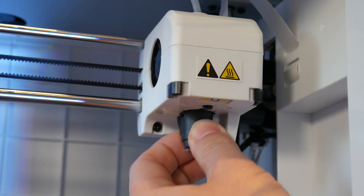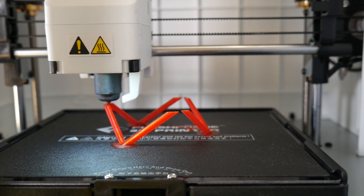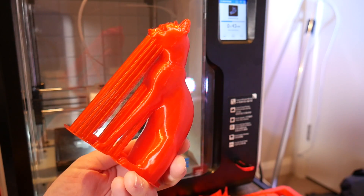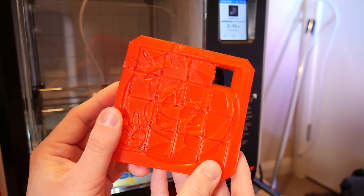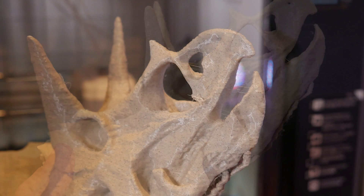For those who like to DIY their way through nozzle blockages, that'll be a big downside — it's not user-serviceable at all. But for schools, universities, or time-poor hobbyists, it's pretty awesome to swap out nozzles and get the next print underway straight away. My first test prints were done using the default settings in Flashprint and the tiny sample spool that came with it, and the prints came out pretty nice. The calibration cube was near perfect, this Gator Anderson cat is super smooth at 0.12mm layer heights, and my clearance gauge got down to 0.3mm gaps. However, the printer struggled to print a sliding 15-piece puzzle properly, with the parts welding together. I noticed the corners were curling up a little, which I suspect is a cooling issue. A Triceratops printed in Polyalchemy FX looks really good as well, other than a few wispy strings.